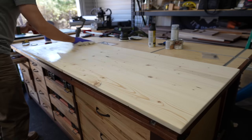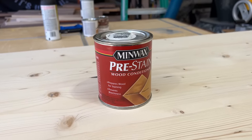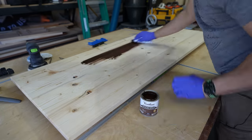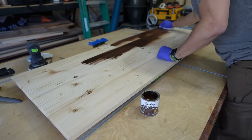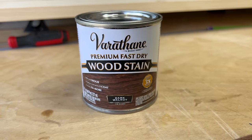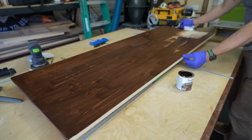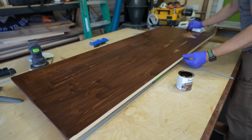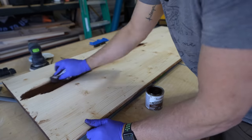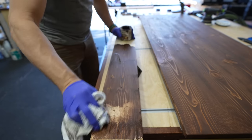While the paint was drying, I applied pre-stain conditioner. I always use pre-stain conditioner when staining because it keeps the stain looking nice and not blotchy. I put that on both sides of the tabletop, then applied the stain. I'm using Varathane in dark walnut — I actually like this stain a lot. It dries fairly quick, in about an hour, so you don't have a lot of wait time. Spread it over the entire surface, then wipe off any excess — I let it set for less than five minutes. Do both sides that way. Don't forget that one board we left out — it needs to be stained as well.